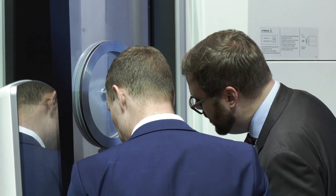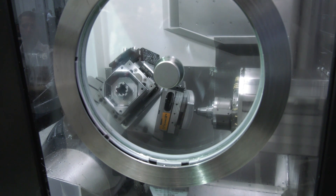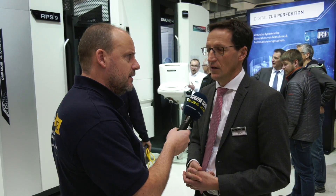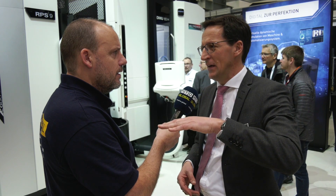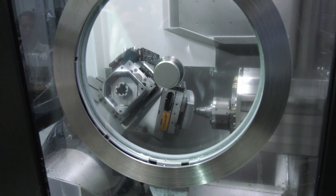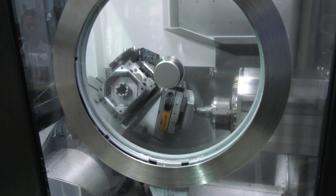Let's look at the horizontal spindle and its benefits. Chip fallaway is one advantage. And regarding the table kinematics — yes, you can work with a horizontal table position with the table directly in front of the spindle, and you can also go completely upside down and even past that position to machine negative angles. So you have a really unique working area where in all positions you can machine the parts and reach all table positions.